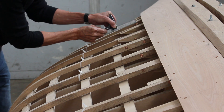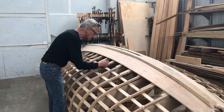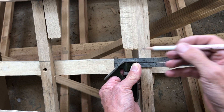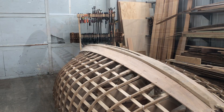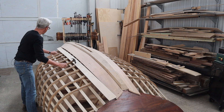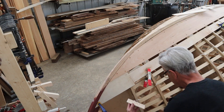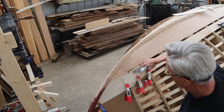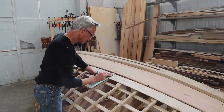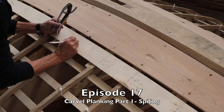I first checked that the frames didn't have any bilge curve to them — still flat. Since I'd already lined off the hull with the ribbands, as I had shown in episode 5, I transferred that to the top of the frame so I could use it for spiling. I prepared a spiling batten out of a piece of quarter-inch plywood about three inches wide, then made a hood end pattern and attached it to the spiling batten. After marking out the frame stations, I began spiling — all of this covered in episode 17, part 1 of Carvel Planking.